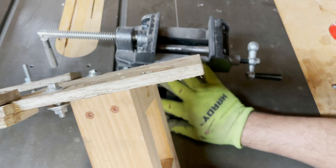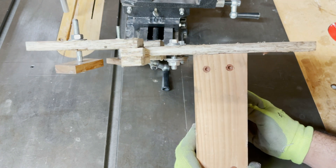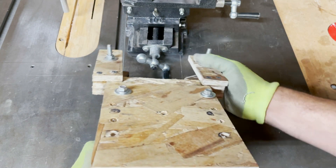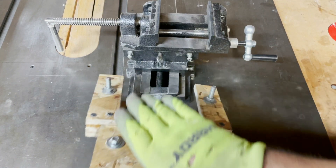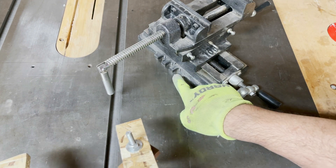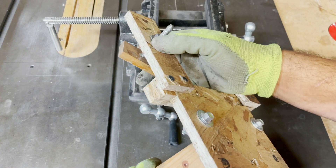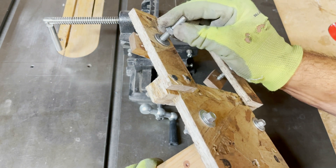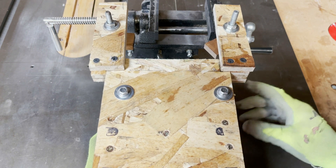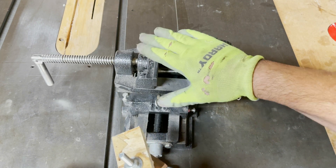In order to do that, we're going to need a jig — and famous words, always need a jig. This is a simple jig here. This mounts in a lengthwise orientation like this. These bolts here hook up to over here along the side, and these right here drop inside the tool bed. Then you just tighten those up and get that square, and you're pretty much good to go. You can use this on the wood lathe with a couple attachments.